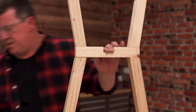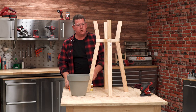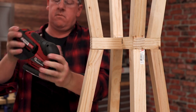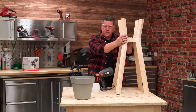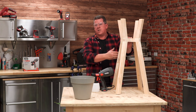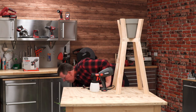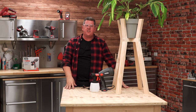Now that we've got all the pieces glued together, it's just a case of connecting them. Get yourself some timber putty that's the same colour, especially if you're wishing to put some stain or some oils on it. Just putty off all of the imperfections, all the cracks and grooves that might be there. Then get yourself a detail sander and just sand off all those imperfections. Now we're on the home stretch of completing our DIY pot plant stand. We've cleaned up all the edges, now it's time to put some sort of finish on it. You can decide whether it's a full colour paint, maybe it's a stain, or just a clear oil. Either way, the spray gun will make really easy work of that. Then put your pot in, decide on your plant, and now we've completed our DIY pot plant stand.